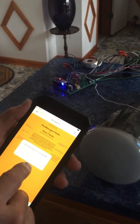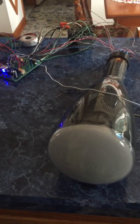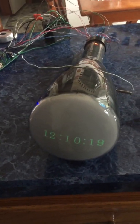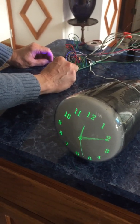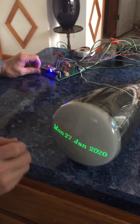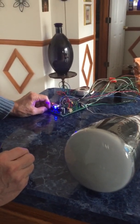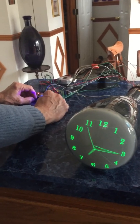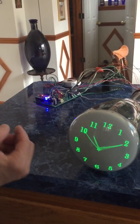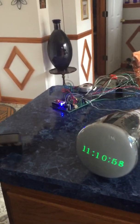It pulls up the connection page and it's automatically connected. The neon light comes on, the relay clicks, and as soon as it warms up the screen comes up. It's an hour ahead, so to correct the time go to the date screen once — press slow set and toggle and release — and we get the correct date: today's the 27th, Monday. From there hit fast set to go back to the time screen, then hit fast set, hold it, hit toggle and release to refresh the time. Now our time is correct, and that's all there is to it — this is OSC 7.0.